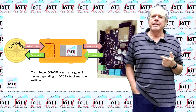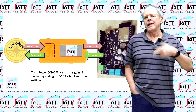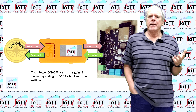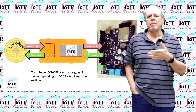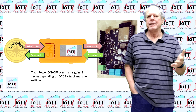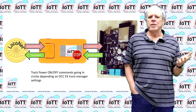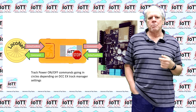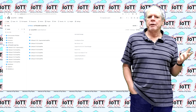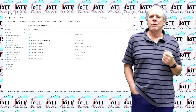On the IoTT stick software there is one minor modification, but I think it is more related to the latest DCCX software version than to the command station hardware. I noticed that in some cases sending a command to turn the track power on or off could lead to contradicting on and off commands going back and forth indefinitely between LocoNet and the command station. So I eliminated this condition in the stick software and you should download the latest version before using the Red Hat with the latest DCCX software. This fix is only needed if you are using the Red Hat — for all other hats, there is no need to update at this time.